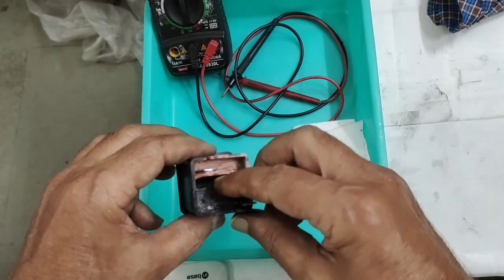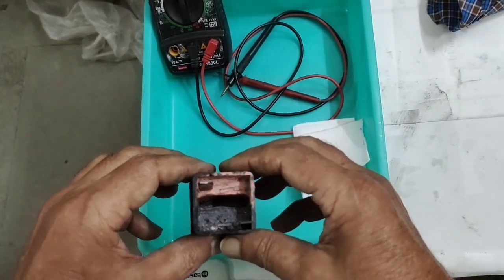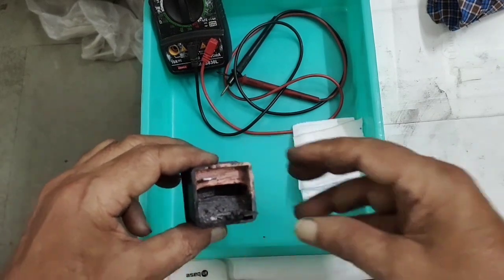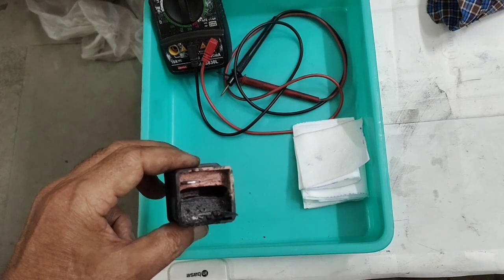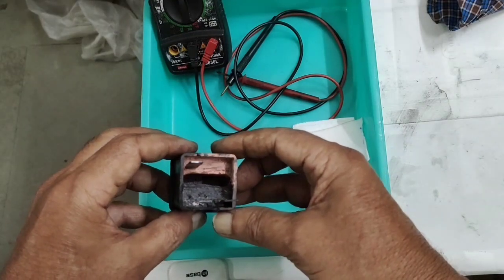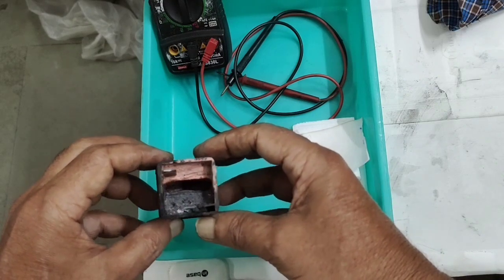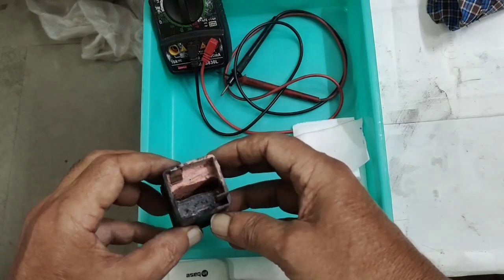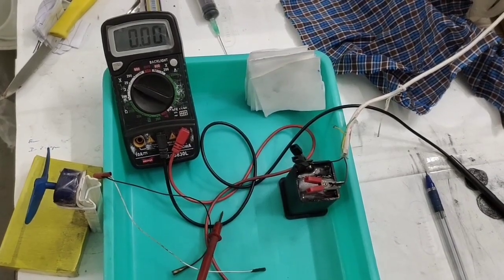In the center I am going to fill this with a ceramic fiber pad, through which the sulfuric acid electrolyte will soak. The forming and charging methods will be the same as in my previous videos on lead acid batteries: dry for 24 hours, then soak in 10% sulfuric acid, 20% for forming, then 35% for charging.